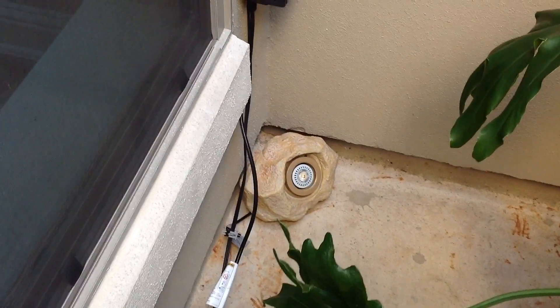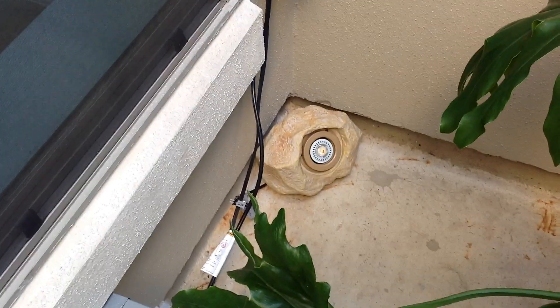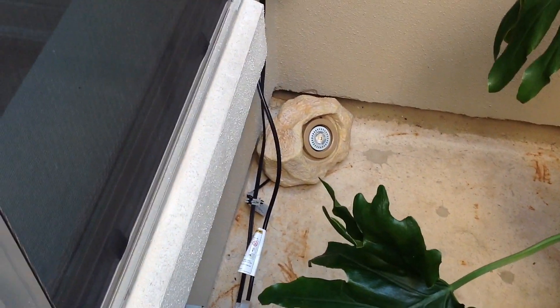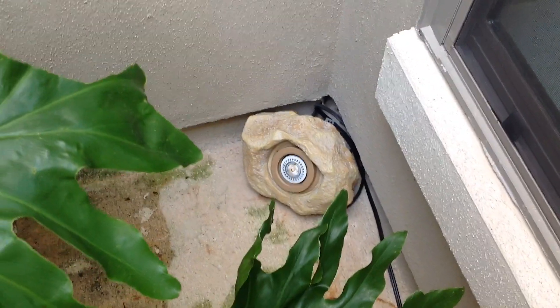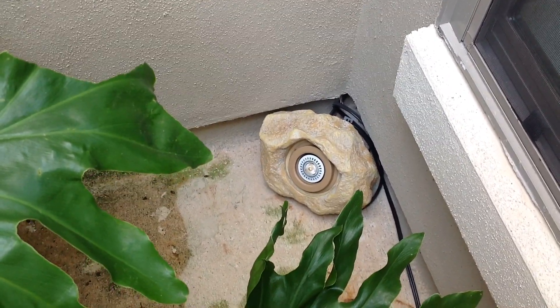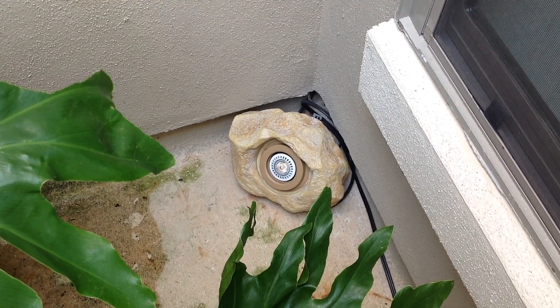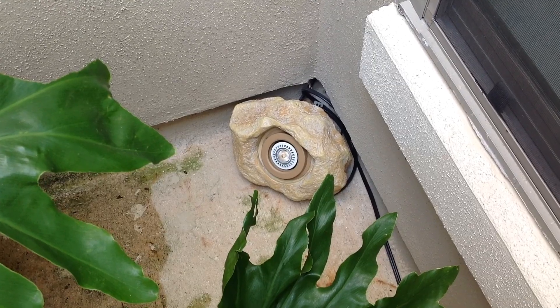Okay, and here we see the finished product. I've mounted the transformer on the wall, plugged it into my outdoor electric outlet, and ran the photocell all the way up the wall to a place where it gets plenty of light during the daytime, because this is an enclosed courtyard type area. There's the finished rock light — at dusk the light will turn on and illuminate my garden, which is exactly what I'm hoping to do. Here's the other one over in the other corner. I probably need to do a better job of hiding those electric cords, but I'm pretty pleased with the way this came out. It seems to work good, so I'll report back and see how these bulbs last over the long haul — hopefully they'll turn out to be a good retrofit that will save some money and electricity and also give a good useful life. Thanks for watching.